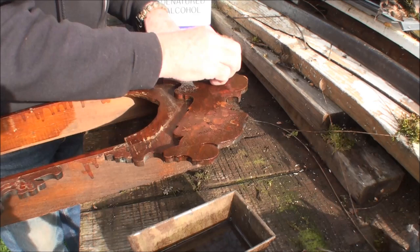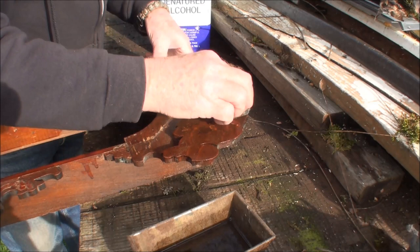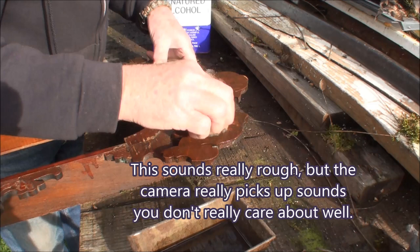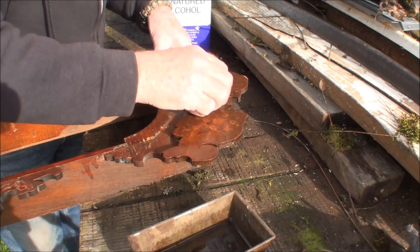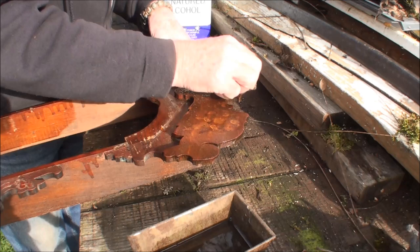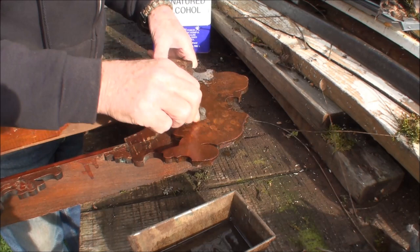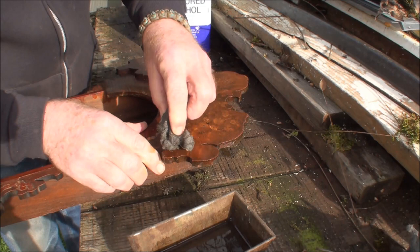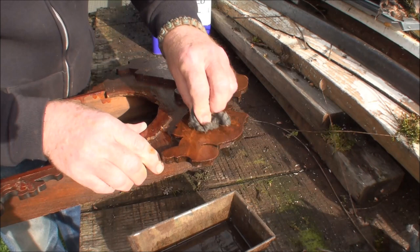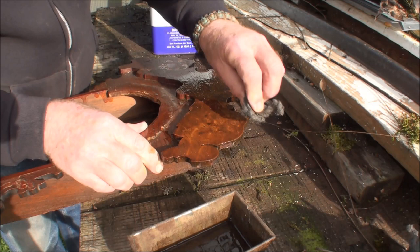Considering it looks like it might be doing something, but like I say, I got that varnish on top of the other varnish. That's smoothing right out. So pretty much what it's doing is just remelting what's on there. And if you weren't as thick as I am, you'd probably dry this off and either give it another coat, a spray coat on here, or you can strip it all the way down. Yeah, it's turned out pretty good so far.